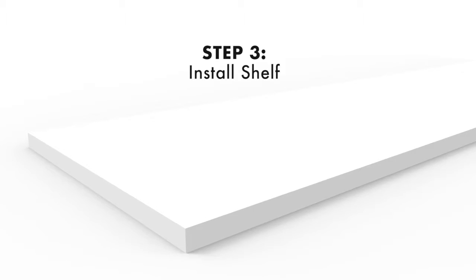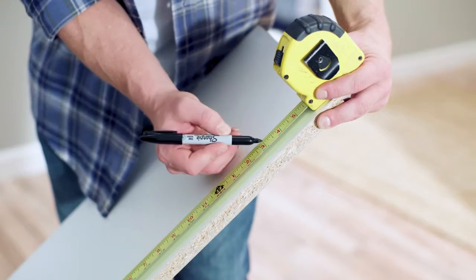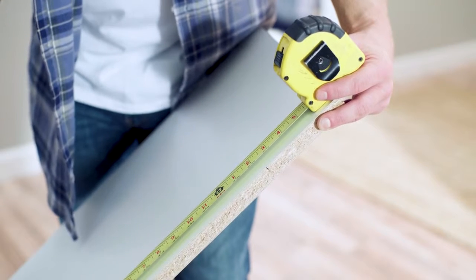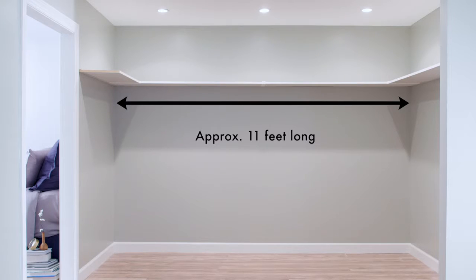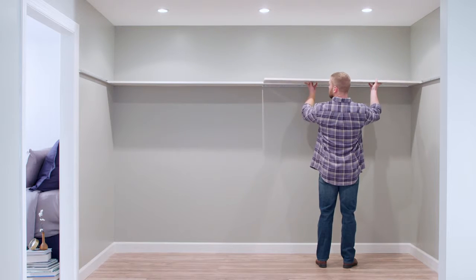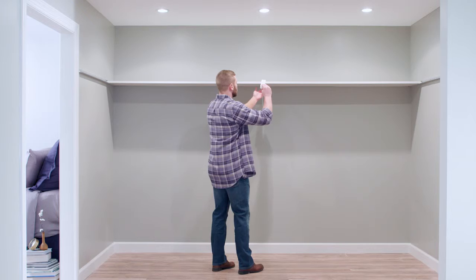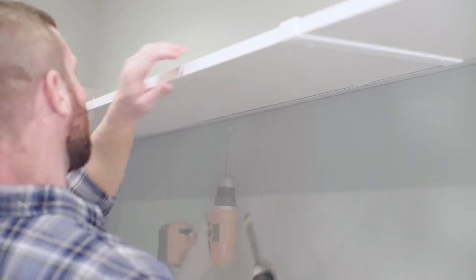Now we're ready to install the shelf. For this demonstration, we have three shelves to install: one across the full length of the back wall, a second shelf with an open end on the left, and a third shelf across the full length of the wall on the right. We will begin by installing the back wall shelf first. Measure the area and cut the shelf at least 5 eighths inch shorter than the length of the wall, but no more than one inch shorter. Our back wall is approximately 11 feet in length, so we will join two 65 and one half inch long shelves together. Slide the first shelf into the back wall channel and to the left, then slide the second shelf into place. Since the shelving is longer than eight feet, you will need a straight H channel to join the two shelves together. Insert the shelf joiner between the two shelves, then attach the shelves to the back wall channel using number 6 by 5 eighths inch flathead wood screws.